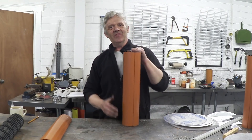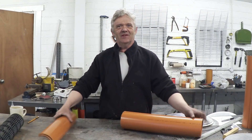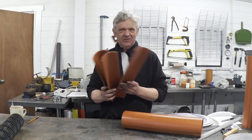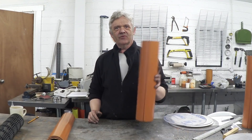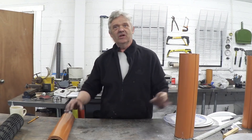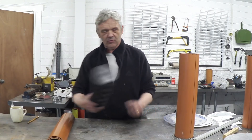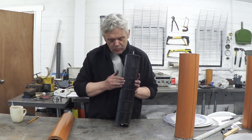After you've gone around a few times, that's what you're going to get — a large disc of acrylic. You want three of them. In the drawing there were a whole load of aerofoil shapes, but there's no way I'm going to make aerofoil shapes — that's just too many and would take too long. So I got some 110 soil pipe, marked it into three, and cut it into three sections. I need 12 of those, so I got four pipes and cut them into three, giving me 12 fins.